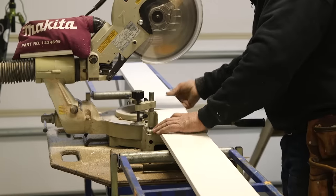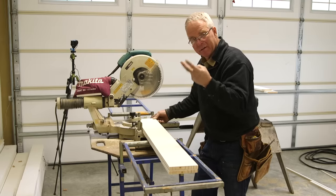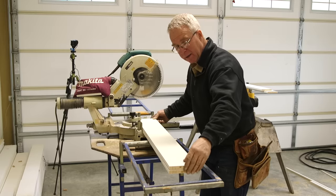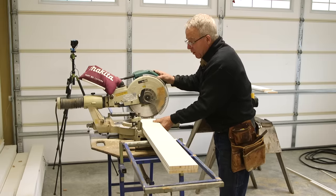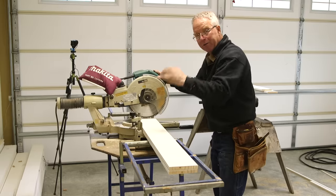I have enough of a production mentality that I like to gang cut, and even when it gets right down to two legs the same length I just as soon cut them at once. Even if I have to cut twice, I would like to make the final cut simultaneously. So I've got the mark on the top, I flush one end, I bring it over, and this way at least I know that if the cut's not quite right, at least both sides of the opening are going to have the same distance.